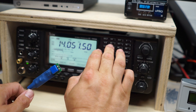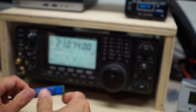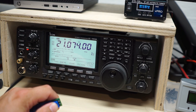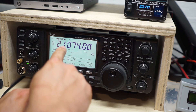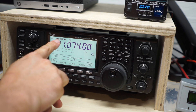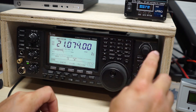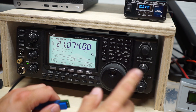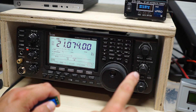Let me show how it works. I'll switch over to 15 meters, reset the tuner, go into tune mode, and then press the button - it just works. When you press the button, the radio thinks we're tuned and the tune annunciator comes on. Note that it will come on even if the tuner doesn't find a tune, so you do have to keep an eye on the tuner. But here we're getting 10 watts and a perfect SWR of 1.01.